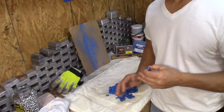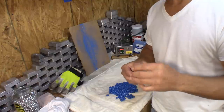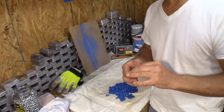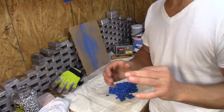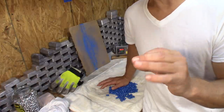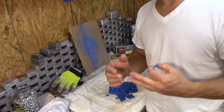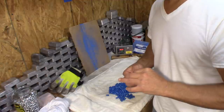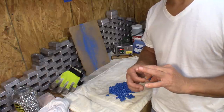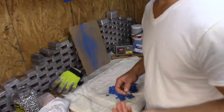What that tells me is: if we're starting with 20 BHN and we want 17, we can run the temperature up another 10 degrees. I'm just floating this out there — I don't want to complicate or confuse anyone. This is a subject that's going to continue for some time, and there'll be a lot that comes out from more testing I do and feedback from you guys. It's really not complicated — it's just a way to control our BHN when we want a higher BHN.